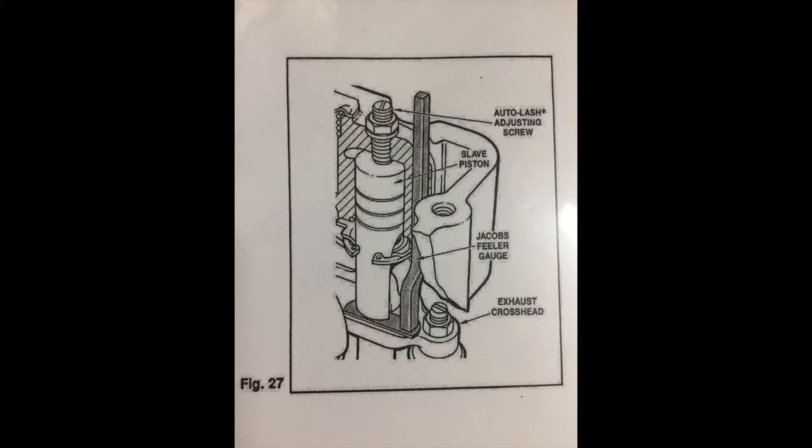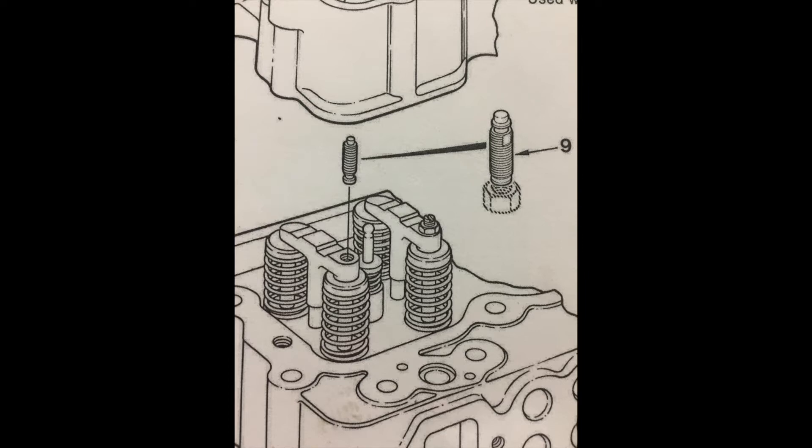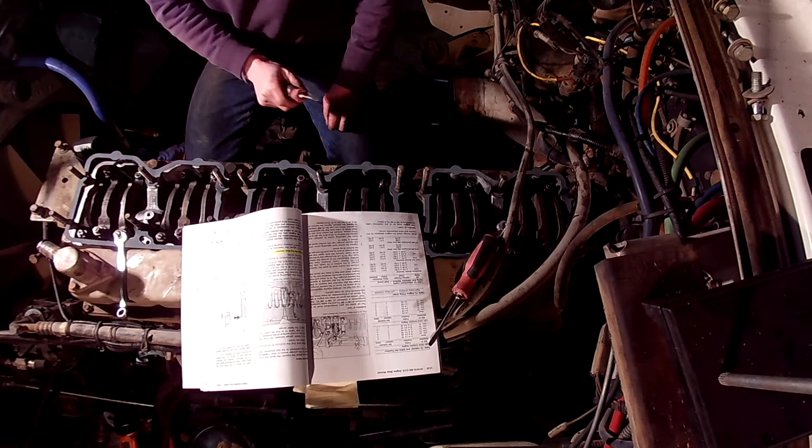The 25B, 30E, 400, 400H, and the 420 series operated as a two valve principle. The retrofitted exhaust bridge allowed one valve to be engaged while the other stayed in a fully seated position, but there are no free lunches. After every engine brake cycle, a motor still needs to cycle through its four strokes: intake, compression, power, and exhaust.